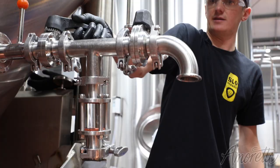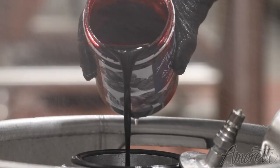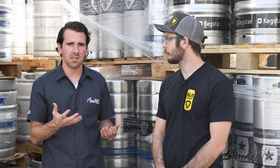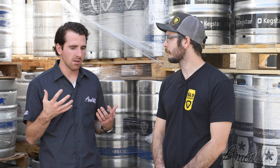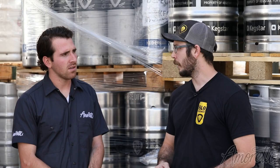We infused the beer going from fermentation to the bright tank. If that was the artisan — which is obviously a bit thicker than the craft puree — what would be the best way to make sure a 580-pound artisan drum is thoroughly mixed and blended into the bright tank? The way we do it with our Blood Orange is we set up a rig from the fermenter going through a pump into the bright tank. We push the beer from the fermenter into the bright while simultaneously pulling the puree — or in this case the artisan — out of the drum inline going into the bright tank, at a slow enough rate that it mixes in throughout the entire process and homogenizes evenly.